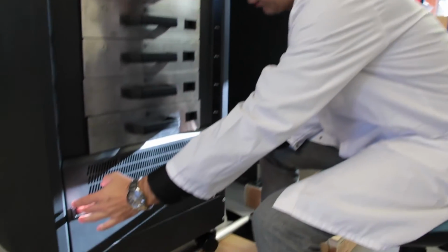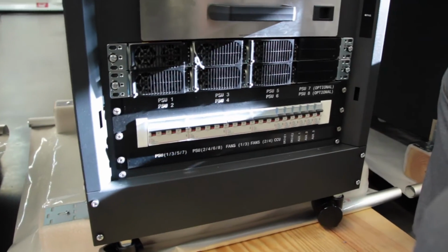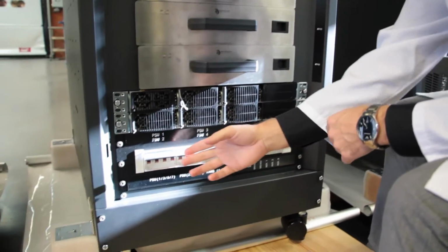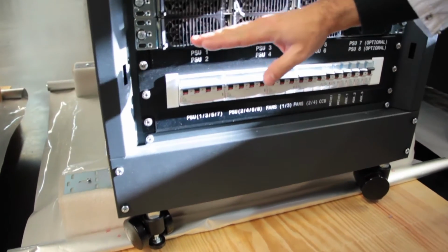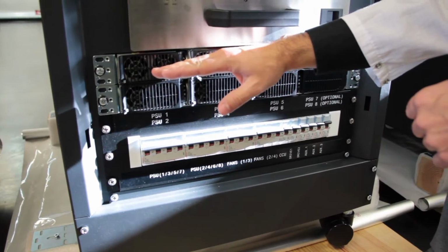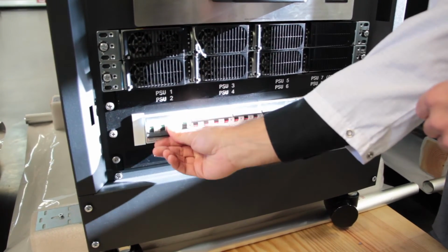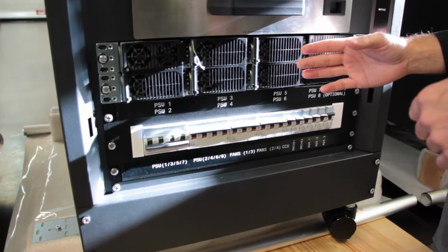A very important part of the Ecreso FM transmitter are the power supplies. So they are located at the bottom of the rack. We can remove this part so that you can see inside. Here we have the power distribution section, on which we have 2 redundant breakers. Each breaker will feed half of the power supply section. So if you have an issue with one of those power supplies, only one breaker will protect, but the other will still supply the system, and you will be able to broadcast at least with 5 kilowatt on air, which is very nice.